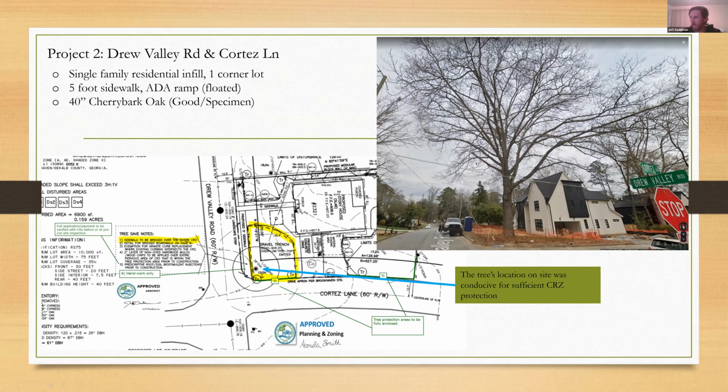But you had to get into the execution, right? Because if you've ever seen this done, these guys will usually excavate about 2 feet off the back of the curb just to be able to get equipment in there and lift these massive slabs of granite. And I said, okay, yeah, I think we can pull this off if y'all can find a way to only dig back several inches and basically grapple it and extract it out of the ground and set it back to grade that way, with minimal excavation behind the curb towards the tree.